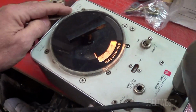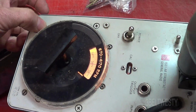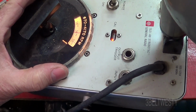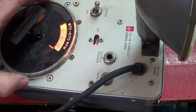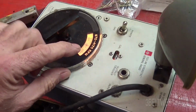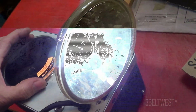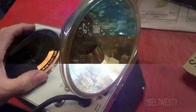And that's this dial. This one on my particular unit here, I'll have to look at the schematic. The pot's, I need to replace that pot or put another one in, because when you adjust it, it gets to where it has a big jump. Hertz. This is RPM. So that's, divide that by 60, 1800, that's 30 flashes a second. So this is probably going to really screw up with the filming right now. It's around 29.5 to 30. That's why that's freaking out right there.